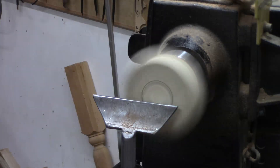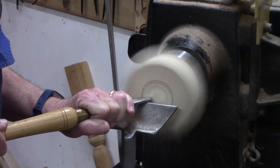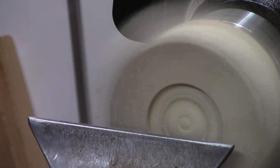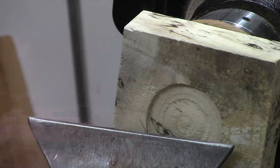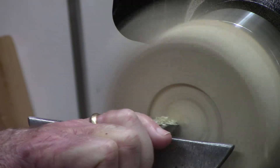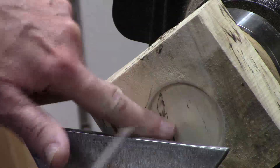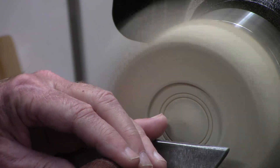I'm using my dovetail tool. I'll come in there and cut it. I've got nice clean shoulders and a recess. I'm going to smooth this up just a little bit and finish the recess using my skew as an aid to scraper, just to flatten it out a bit. I'll sand that and put a couple of V-grooves in there to kind of finish off the bottom.